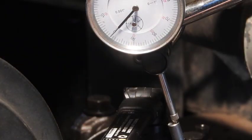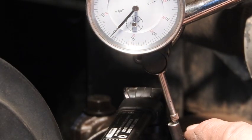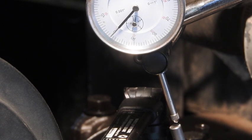The camera's not in line so you can't actually tell, but it's directly on zero. We're going to watch for movement of the needle and separation, and then determine that the piston is perfectly where it needs to be. You can see the separation and the needle moved just a little under zero.